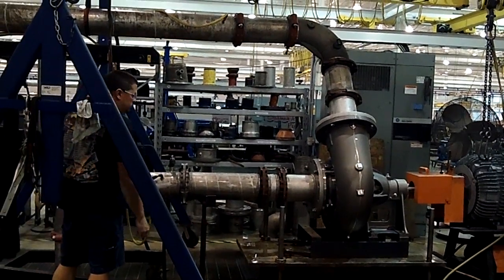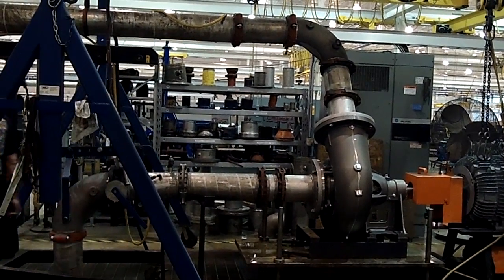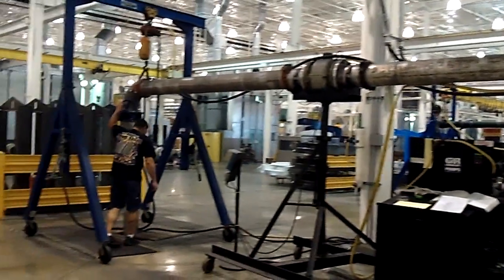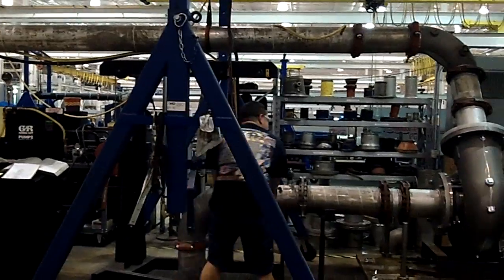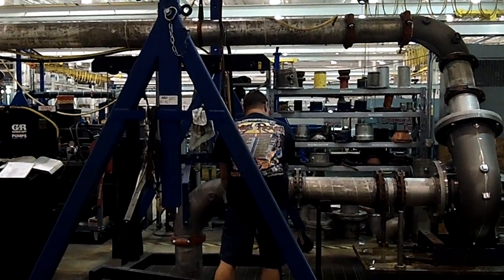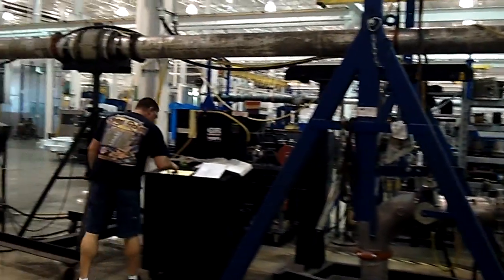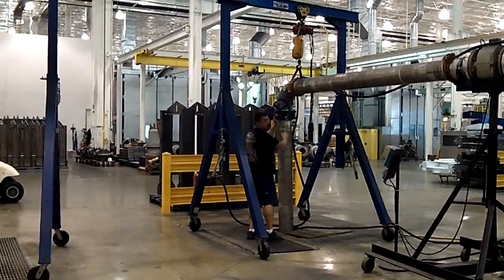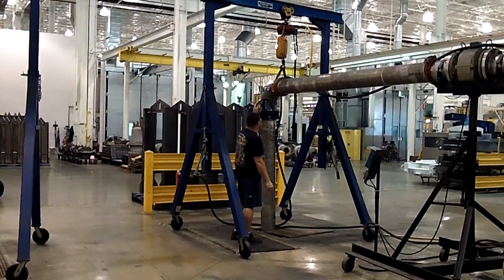So Jim started his dyno now, and he's going to run the pump up to speed, and it'll go through a priming cycle. We'll hear a little bit of noise as the pump primes. And then once it goes fully dynamic, Jim's going to be watching all of his gauges. He's going to be looking at his heads and his flow — he's got a flow meter. Pressure gauges are calibrated within our ISO 9000. It's a good priming cycle, and there it'll be running at full flow at the RPM that he's selected. We'll restrict his discharge valve and watch for the pump to develop the head that he's selected.